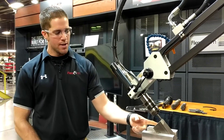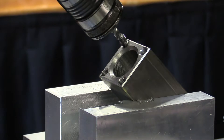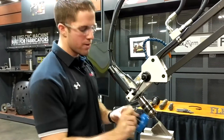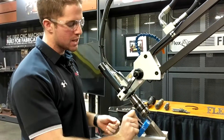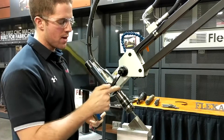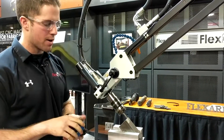What we have here is some 1018 mild steel with a 3/8 tap blind hole. The way we get the FlexArm at that angle is simply by using our alignment plug — we put the alignment plug into the chuck, face it up to the part, then use the levers on the FlexArm to lock that angle so we can follow the hole to the very bottom.